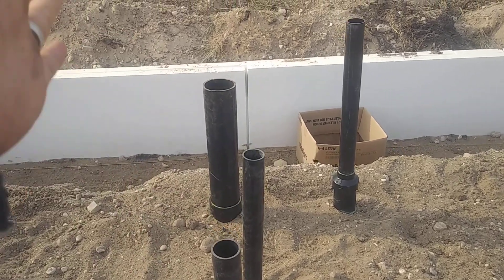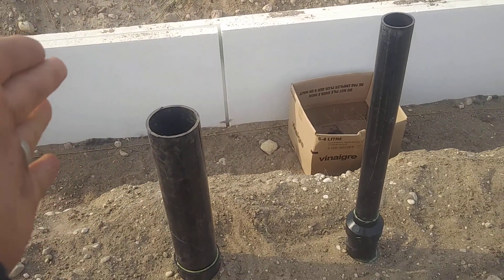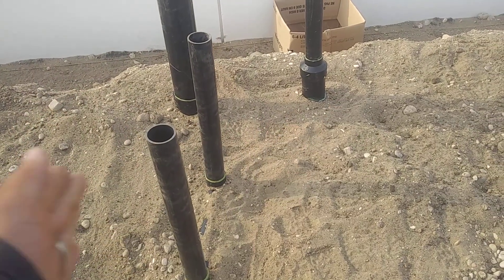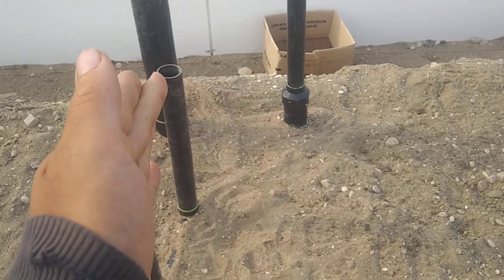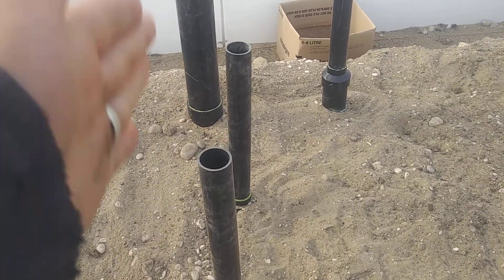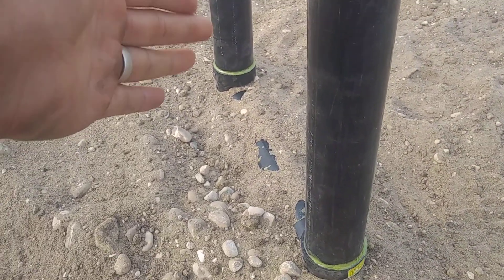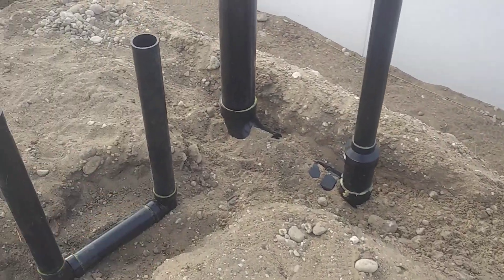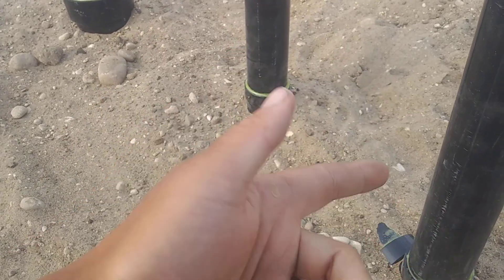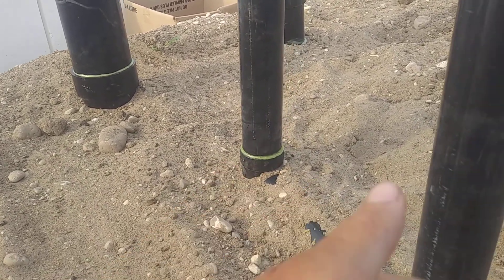It's not 100% perfect but I think it's good enough. The toilet here is roughly about 16 inches away from the wall, so it's a little bit far. The shower drain is to be 15 inches from the wall, and that's where the wall is going to be. Then you have the overflow which sits in the wall. I basically put the p-trap on an angle and that was almost enough to create the offset from the wall.